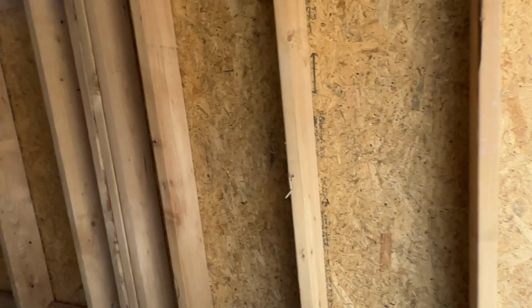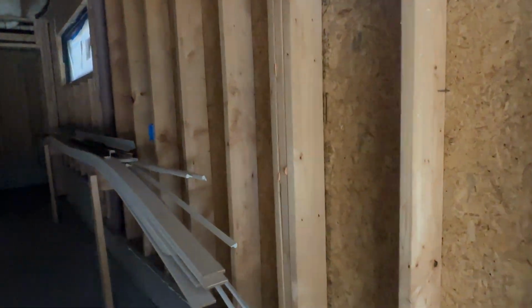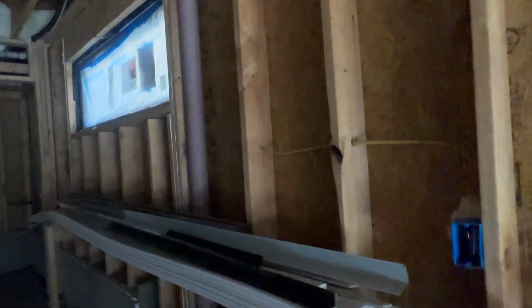Obviously, any of the penetrations we need to seal up, we would use Big Stretch. So on our windows, these all get Big Stretched when we install them. And I think I've got videos that I've done on those as well. You can see they came in and did the draft stop fire block foam afterwards. But all those windows are completely sealed.